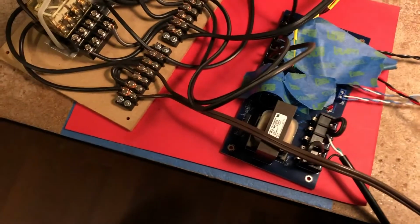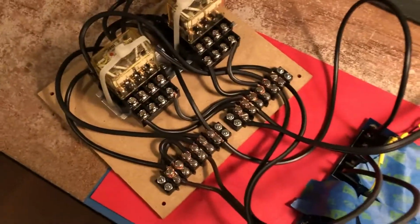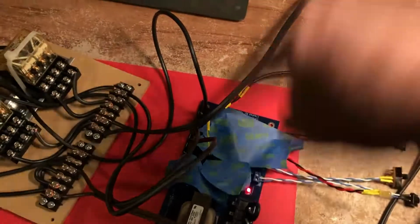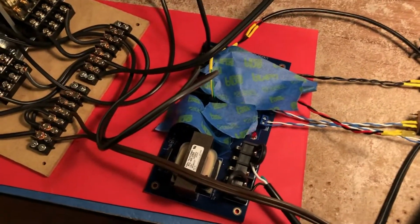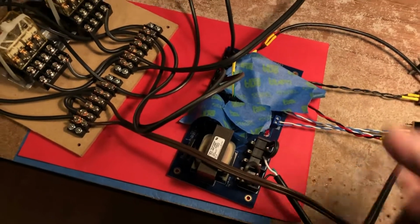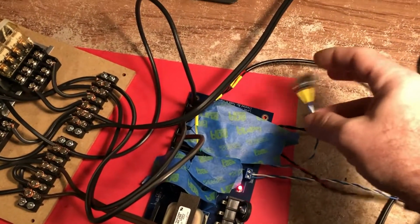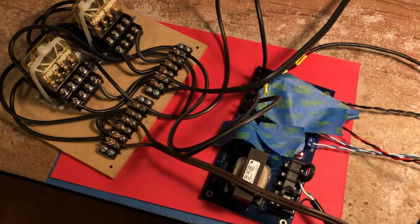And then also, if you look at the Neumann doc, you're not supposed to power the coils to the motor while the start motor is engaged. So whenever you press the start motor button on the lathe enclosure, it actually cuts the power to the main coils in the Lyrec. So this system does the exact same thing. It allows you to take an impulse from that switch. So you will rewire that switch.